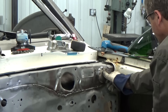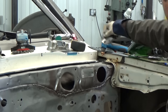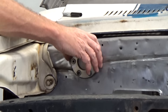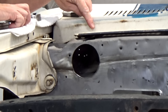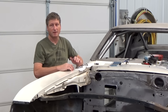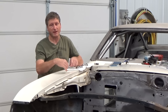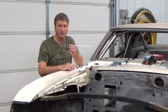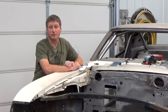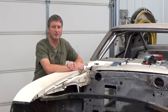Just a little bit of finish grinding and that will be perfect. Now I have to figure out my bend for the short connector bar, which also has to run through another inner wall before mating up with the A-pillar bar. To do that, I drilled a series of one-eighth inch holes in the inner wall to find the best place to make a template out of this piece of 3/32 TIG filler metal, which will also serve as the centering point for the hole saw and make a nice tight fit for the tubing to pass through.